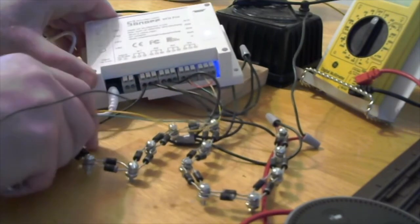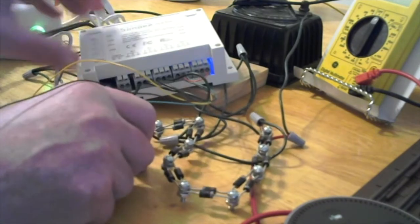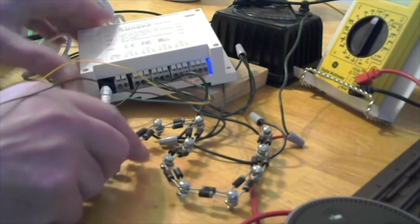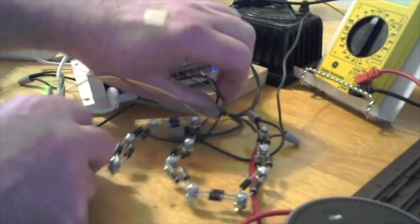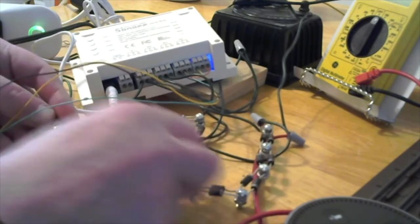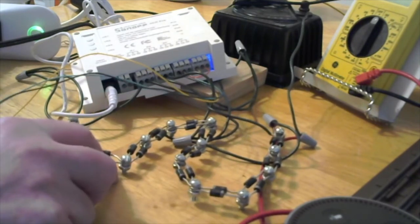So that's essentially a diode string reduction, crude but safe, effective, almost a pure sine wave out from this. In fact, it looks like a pure sine wave. You just have the reduction of the voltage, and it's kind to your older equipment. The diode trick is a very good trick to reduce voltage from a fixed wall wart. And this configuration will pass AC or DC, DC of any polarity, and of course AC. So, very good technique, and simple to do. So, that's it.